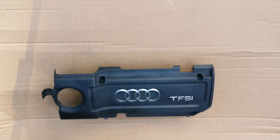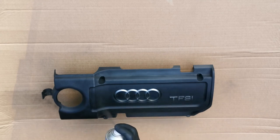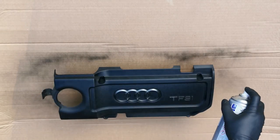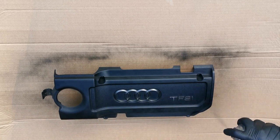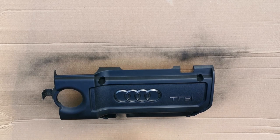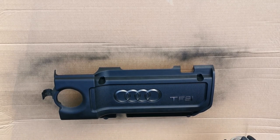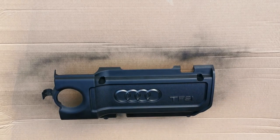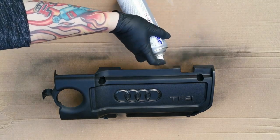As you can see here we are taking our time giving it a few coats of satin black. This is any satin black that you can get — I have left a link in the description so you can check out the satin black that was used. You don't have to get any specific type; just cake it on nicely. If you're putting it on, stay about 30 centimetres away. You don't want to get runs in it because it will show in your hydro dipping wrap when you come to do that.